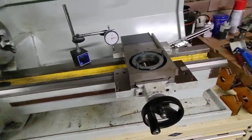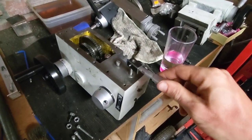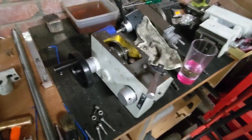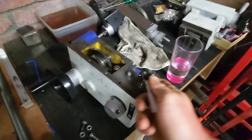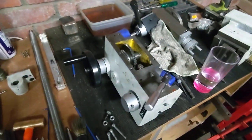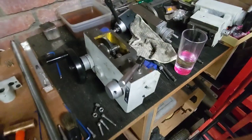I've disassembled the complete tool carriage so I can get in there. One of the chief issues was the detent for the power feed — the power travel in X and Y — the detent was too soft. A couple of times I was taking it out of left-right travel and going straight past the neutral zone into the forward-back travel, and crashing the tool, which obviously is not something you want. So I'm having a look at that — it's just a ball detent in this one here, a very simple adjustment.